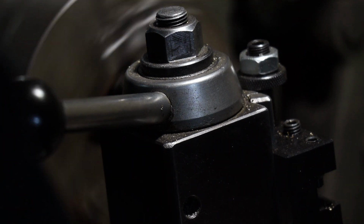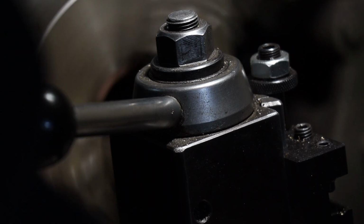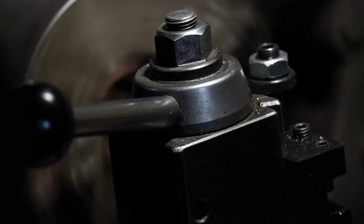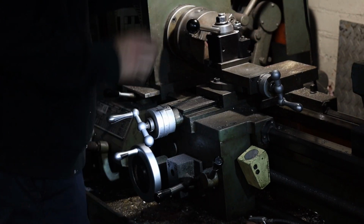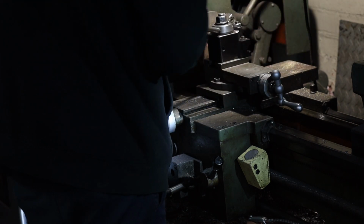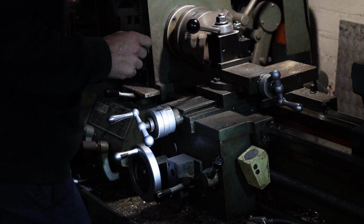So I'm pretty much gonna open this hole, maybe so that there's only like 1/4 of an inch of shoulder left, just to knock some weight out of this cap. Makes it look kind of neat too. Yeah, I didn't think you could see it. This is hard to film. There's no good spot with my lathe up against the wall. I wish I could have the camera over here somewhere, but it's kind of hard to set up. Eventually, maybe I'll make something that can do it.